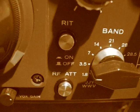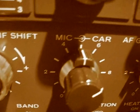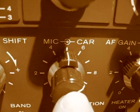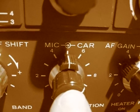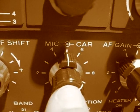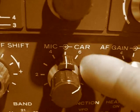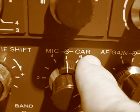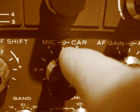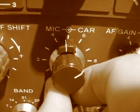All these buttons are off — RIT included. The mic doesn't make any difference. I'm leaving that because it's already set for transmissions I've been having recently. This carrier control can be set either halfway or three quarters; on this radio, halfway is enough. You see that? Half way.